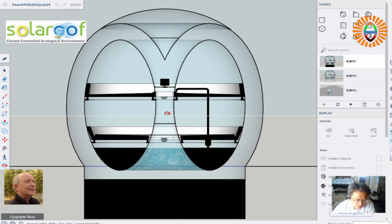The pump gives the pressure, and the soap liquid comes out from the spray head nozzle and sprays onto the screen, and then the fan blows air in, so we have bubbles. The bubbles will be produced first here, and then keep expanding, filling all the gap above the soap liquid, and then there's nowhere to go but up. So the bubbles expand like this and then come back. Same thing around here, everywhere is the same. Because the fan moves air from here to here, this is a negative pressure area and this is a positive pressure zone. Eventually the bubbles have to come here.